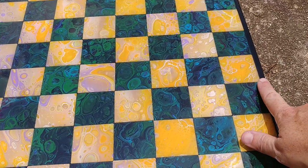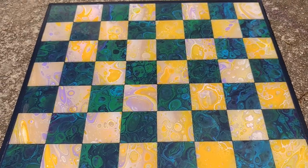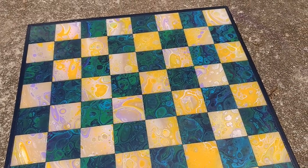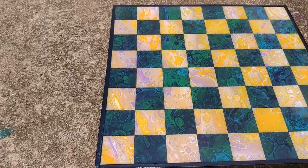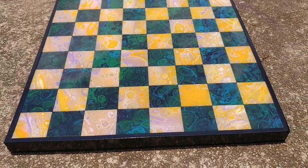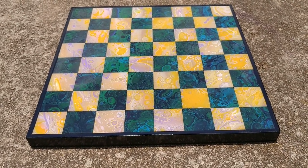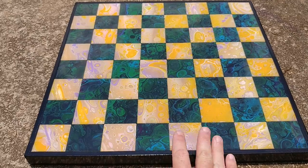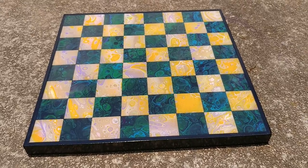This edge piece here was just some fir wood. So really soft, and when I hammered the nails into it, it kind of dented. So next time I'll probably use some oak strips, a little harder wood. Not paint the outside edges before I nail the nails into it, because obviously I had to paint over it anyway. So just paint the inside edges where the resin is going to sit up against, and then paint the whole thing after the first coat of resin before the second coat of resin. Definitely 2 coats of resin was a good idea.